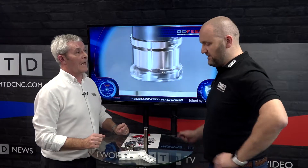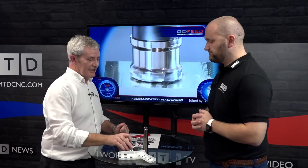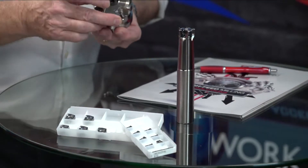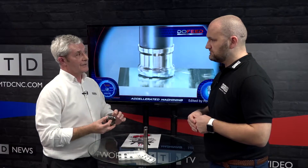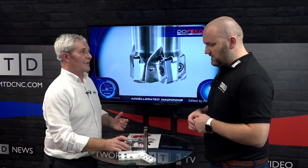200mm — that's a big one. And you can use these on arbors to get into deep pockets. You can actually put these onto an extension arbor, even a long extension. Because of the geometry on the insert and the way the pocket is designed, you can still machine freely without any vibration or chattering.